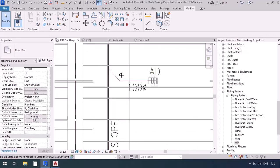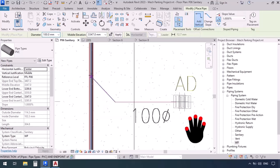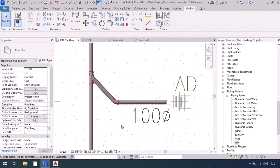Here we have a drain along the way. So pipe command PI — left-hand rule: PVC, WP, diameter. For the elevation, we're creating a junction from the middle so we use inherit elevation. And because we are getting close to the drain we select slope up. Now click, click, and click again, then press escape. We didn't get any extra fittings.